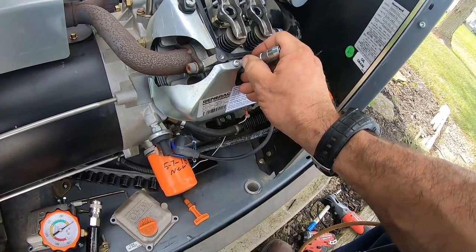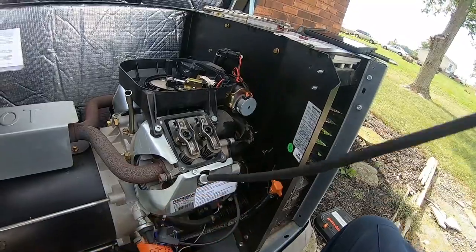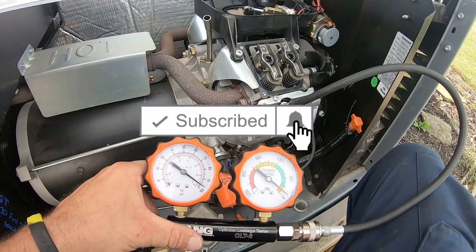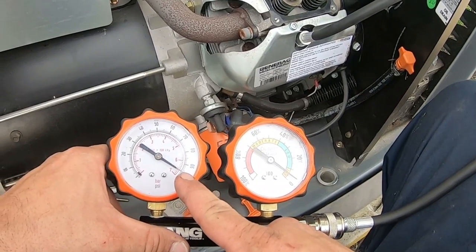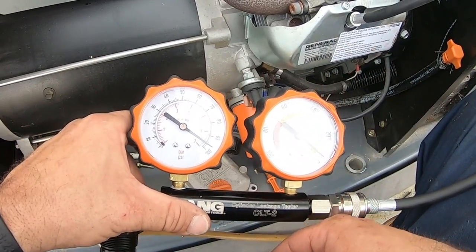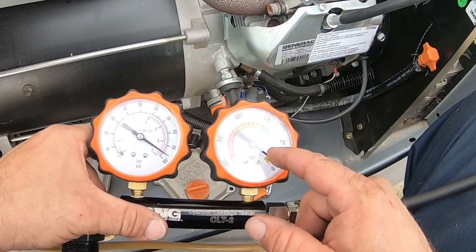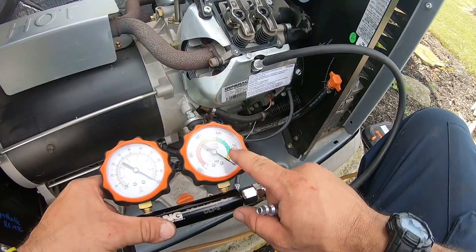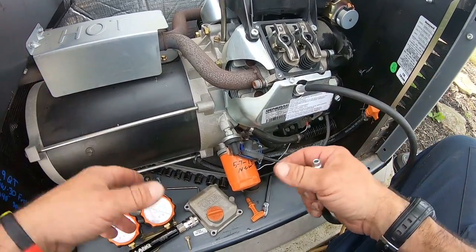Get her to top dead center. What I like to do is push on it because the air will actually shove the cylinder back down. Cut it at zero, and there's what it should have looked like — we're only losing about 5%. Twenty percent is the normal acceptable level. Our pressure coming in is still right at 95 pounds. The book says use 90. You're supposed to zero out your leakage gauge, and that's what I've done. You can hear a little bit inside, but obviously there's a tremendous difference in leakage rates.